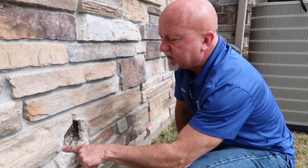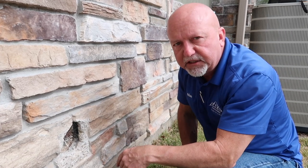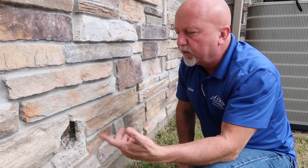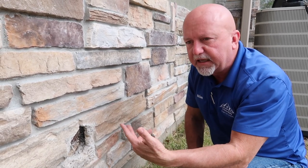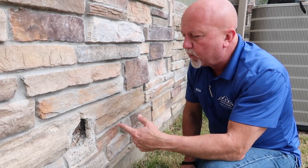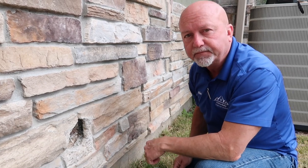Because what we're checking is moisture inside the OSB and the firmness of the OSB. And that's what we're gonna be checking when we're drilling around. So we'll be drilling below windows and around doors possibly, definitely below missing kickouts. And what we're trying to do is see how much moisture there is, if any. Nice.